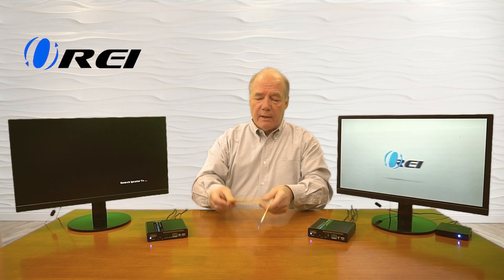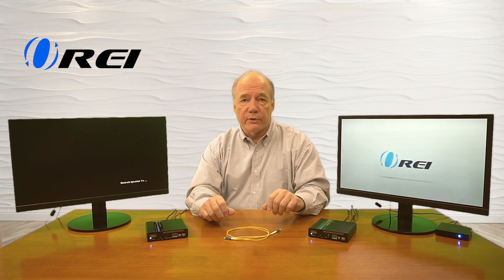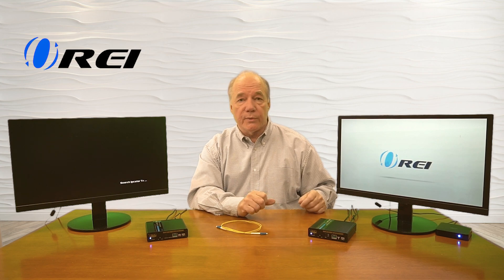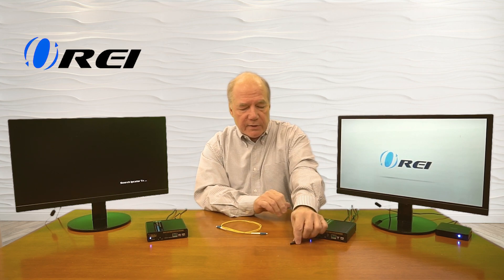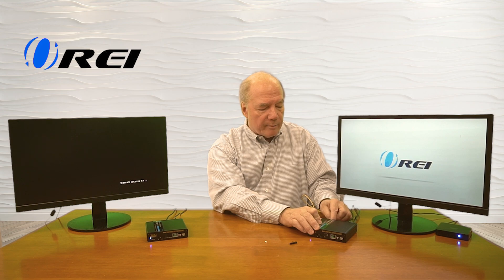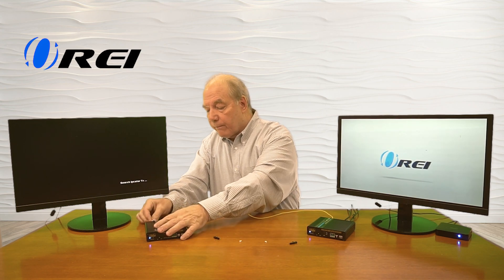A couple of things to keep in mind: unlike land connections, you're dealing with light here, so it's really important that you keep the cable protected and clean and keep the ports protected and clean. This unit comes with two different SFP modules — one for simplex and one for duplex. The simplex has one connection, the duplex has two, and depending on the cable you're running you've got to put the appropriate module in the back. I'd recommend keeping the dust cover on the module and on the cable until you actually plug them in, because if dust gets inside that module it can cause issues with the transmission.